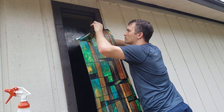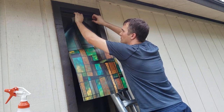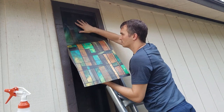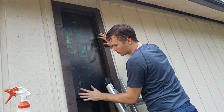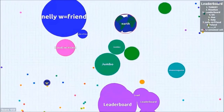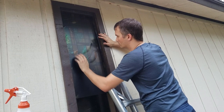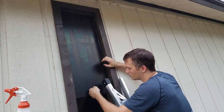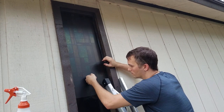It can be a little tricky to get started, but the film just peels right off of the white paper that it comes on, and then you just put it in position directly on the glass. One of the more painstaking parts was getting all the little bubbles out from under the film — this takes a while and doing it with your hands is a lot of work, something like a boring and more physically demanding game of Agario. I found out later that it's way easier to use a towel to push the bubbles around, and having a towel is also nice for cleaning up excess water. After about 10 minutes I had finally gotten rid of all the bubbles.